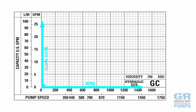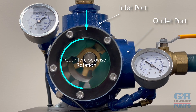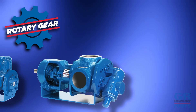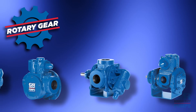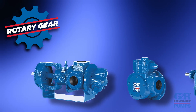The flow rate of an internal gear pump can be adjusted simply by increasing or decreasing the RPMs through the use of a variable frequency drive or a gear reducer. The symmetrical design of the internal gear pump allows for bidirectional flow in either a clockwise or counterclockwise rotation with equal efficiency. The precision machining tolerances and superior materials of construction allow the Gorman Rupp G-Series line of rotary gear pumps to operate at pressures up to 300 PSI, handle a wide range of viscosities without material upgrades, all while providing lower net positive inlet pressure required, or NPIPR, at unparalleled performance efficiencies.